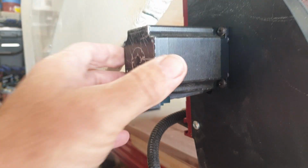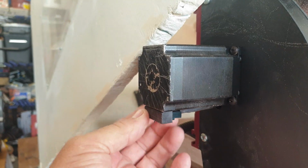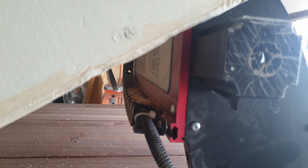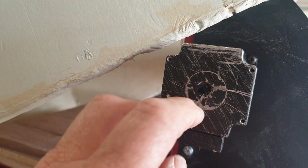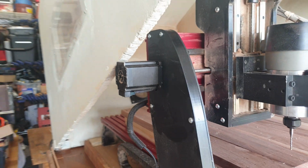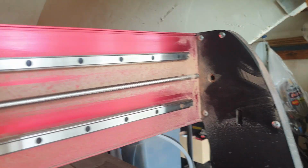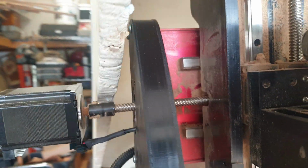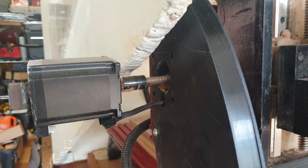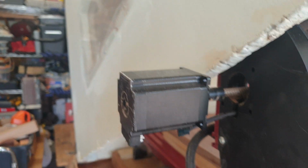Could be a cable. All right, I'll just unplug this cable, plugged it back in, and it's hardly responding. So I'm going to look at the motor. I did blow this out, and see what the deal is there. I think I have an extra motor, so I'm going to look at that. Okay, so I just unscrewed the 4 screws out of there. This slid out, and it came out of this bearing over here. And there's no bearing on that side right there. That's just a pocket. And we'll swap this motor out, put that little coupler back on there, and see what we get.